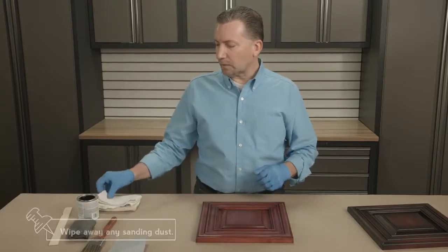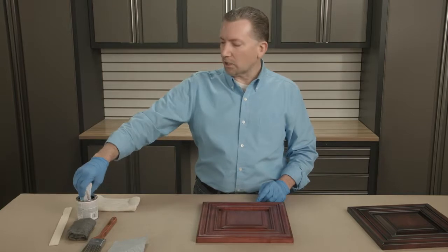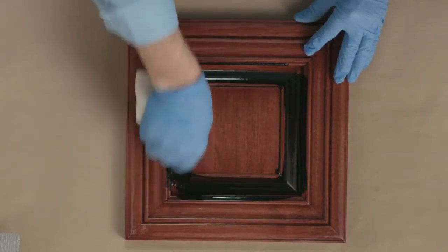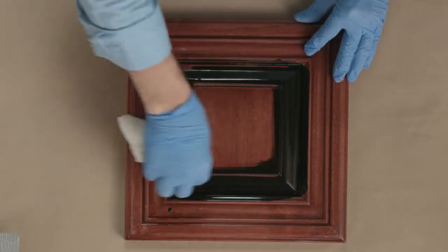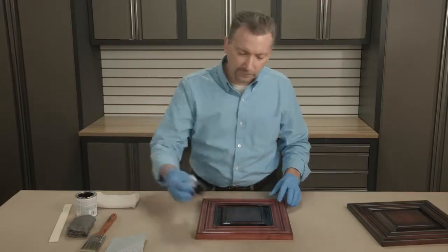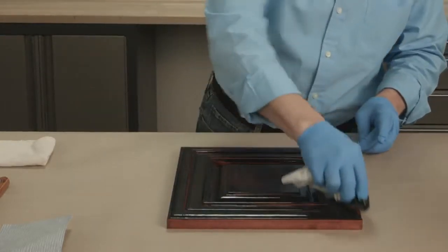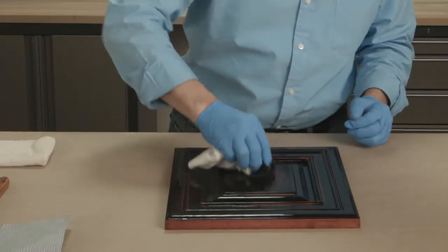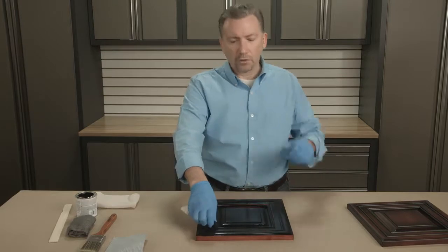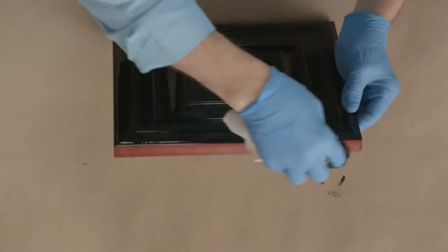For this application, I'm using an ebony or black antiquing stain. I apply this liberally overall, covering the entire surface, making sure that I get stain in all the grooves and crevices. With this particular stain, I'm not really allowing for a lot of penetration because I've got a seal coat on top by using the poly. Once I apply the stain, I get good coverage overall — let me make sure I get the edges.